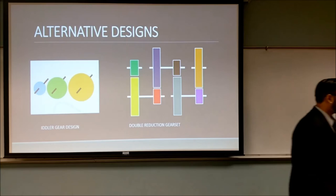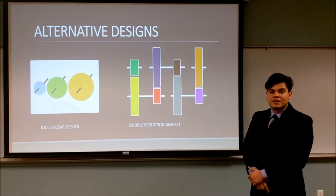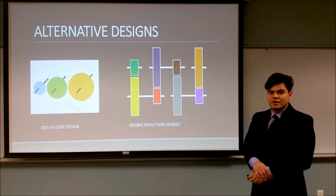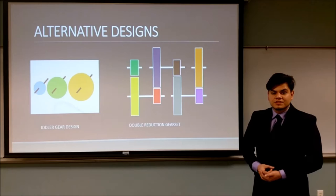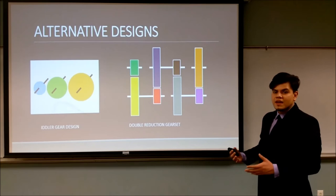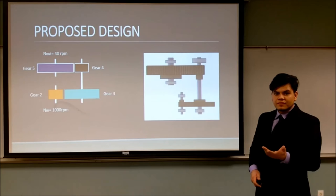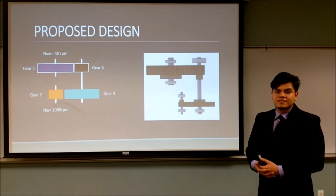For the task provided, we came up with the following design alternatives. First, we have an idle gear set which gives the correct rotation direction; however, this puts the input and output shaft at different offsets and places great stress on the first and third gear. We also considered a two-step double reduction gear set, but the issue is that it is very large and we need a compact design. Therefore, we came up with our proposed design: a two-step reduction gear set that provides the required input and output values. A critical factor is that gear 4 will withstand the highest stress.